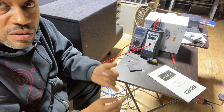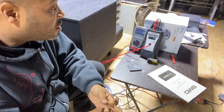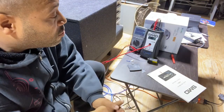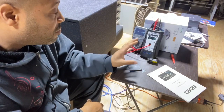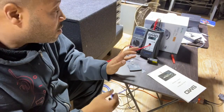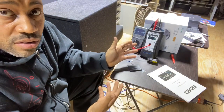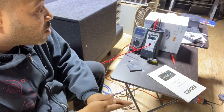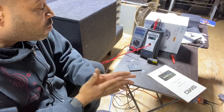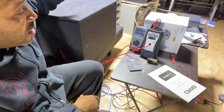This meter can be used to test an amplifier you feel is faulty, to test one you feel is rated unrealistically, and there are a bunch of other ways you can use it. You can use it to test the electrical system in the car to make sure it can give your amplifier enough power to do its job. We don't use it all the time, but when we do, it saves a lot of time. This little device embarrasses a lot of manufacturers building products that don't do what they claim. We use it a lot because we do a lot of customer-supplied parts, and when we're not familiar with an amplifier brand, we can see what it's doing at what frequency, what the RMS power is, and whether the woofer is happy in the enclosure.